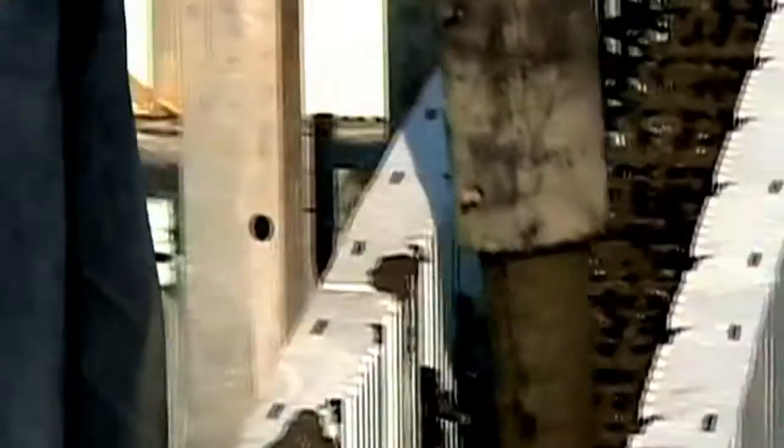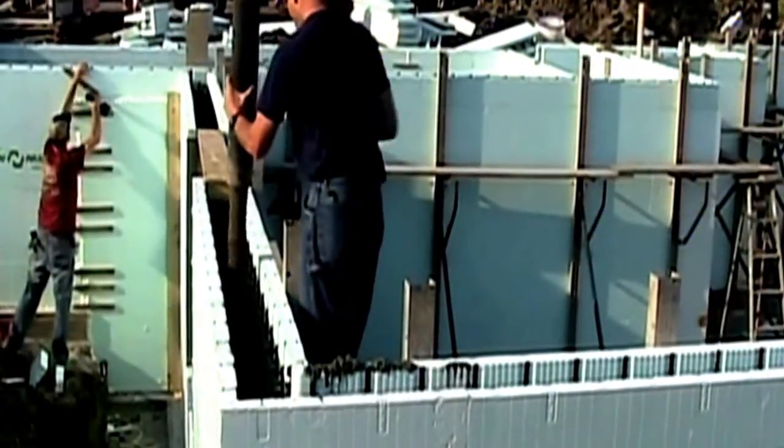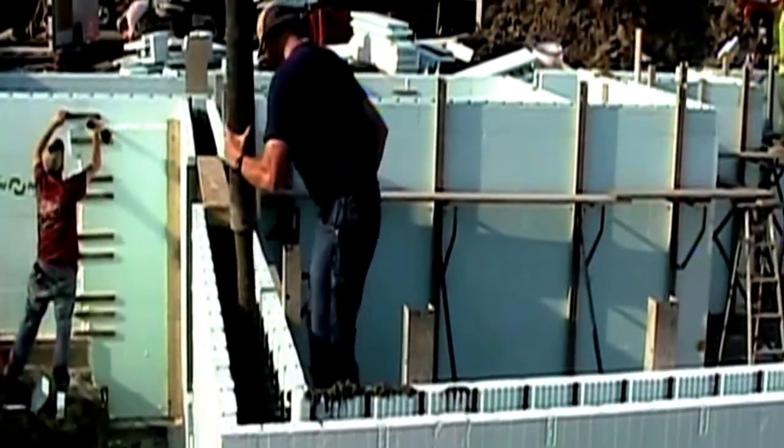But essentially what we've done is we've super insulated our basement. A typical basement is going to be about an R11 and this is an R value of 22. So it's just much warmer, and it's actually safer because you don't have the issue of mold growing.